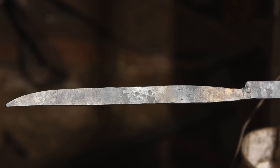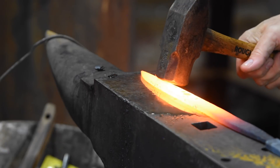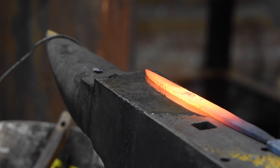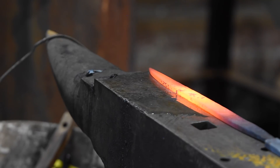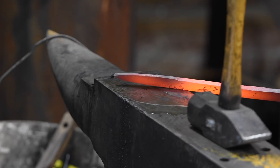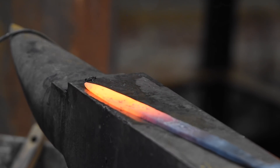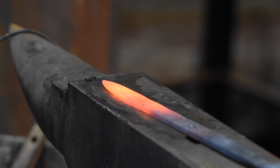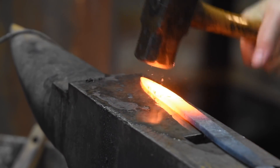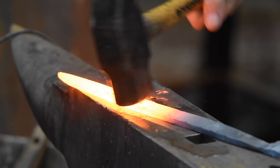The sunobe is complete, so I'll go ahead and forge the bevels. You'll notice that I actually bevel starting on the side that appears to be the spine. The reason for this is that the blade actually curves toward the spine as you forge it, so the preform has built the curvature into what appears to be the wrong side of the blade. I'll be laying in the bevels about 4 or 5 inches at a time — typically I work one side, then flip it over and work the other side, back and forth. Usually it takes about 4 heats to do each section of 4 to 6 inches depending on how thick the blade is, then I work my way all the way up from the tip to the tang.